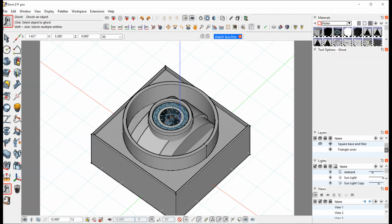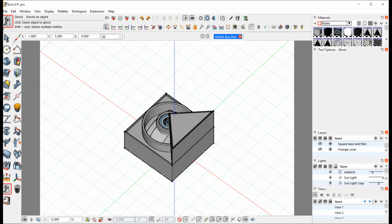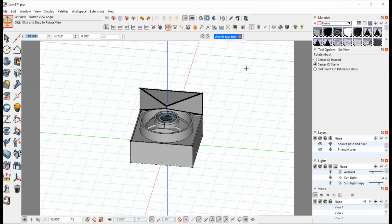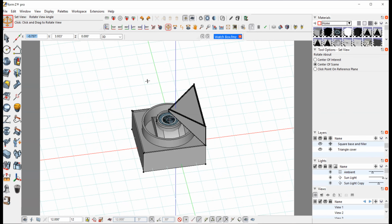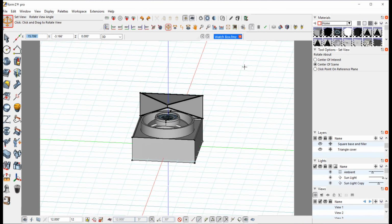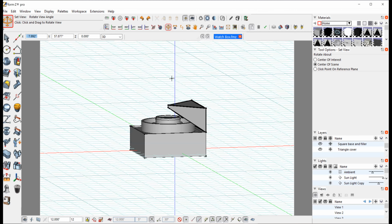So the one part and the more intricate part is this cover component. So from the sketch, you could see I had these four triangular sections that form the square that fit over the top of the box and make the closure. So this was a little bit more challenging to figure out. So I wanted these four pieces to be the exact same height as the base. So when they're open, everything lays out flat on the deck or the surface that you're opening this on. So that was a given. So I had to adjust the heights of these parts to get that to work.